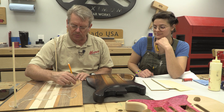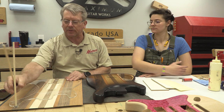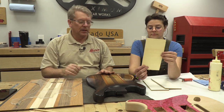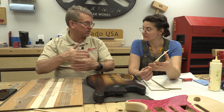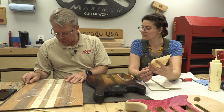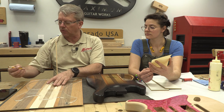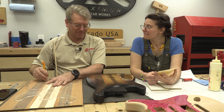And Hannah's going to show us how we do that. And I'm going to need that in a second again, because the next thing that I'm going to do is, we talked about having it in three pieces. Well, we cut ourselves a piece of cross grain maple right there. And it's okay that there's a little crack in there. The glue will all solidify that. But that's why we're crossing the grain, is for that strength. But I'm just going to use, as the extra piece of wood, a portion of this other side that's not necessarily grain matched. And it doesn't really matter. But if I flip it over...